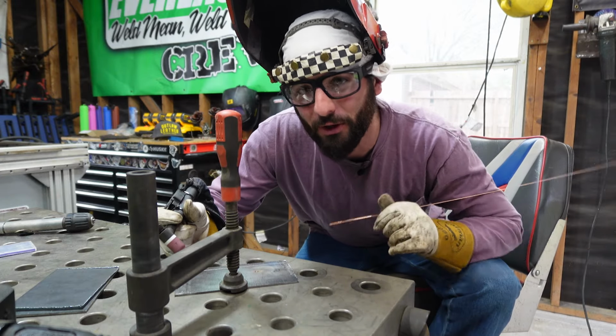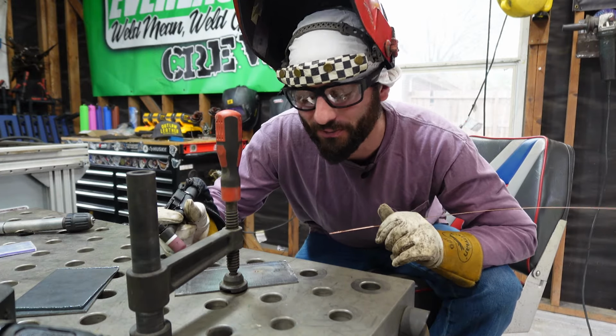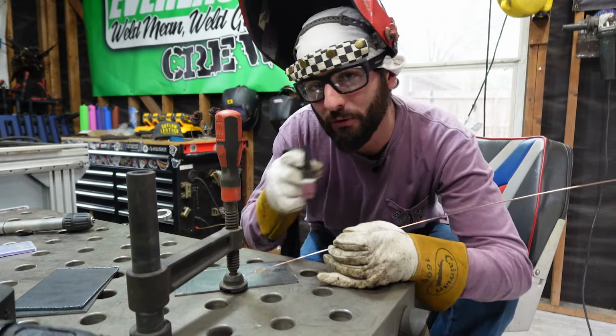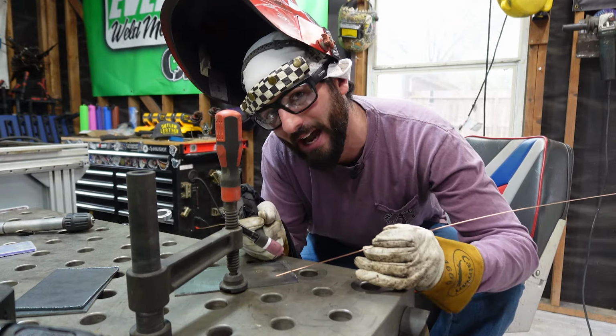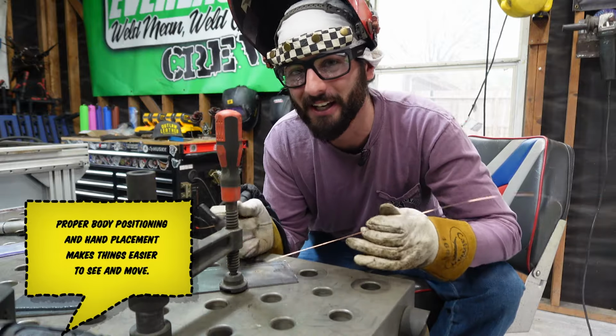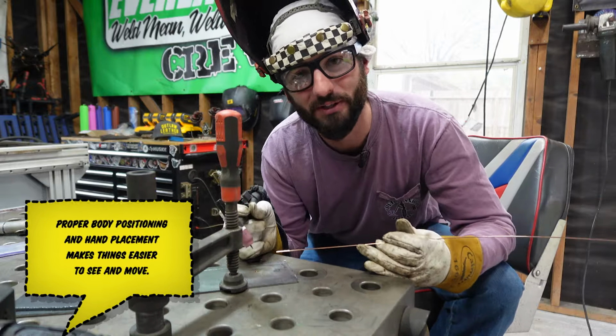That's how you know that your weld and yourselves are equals. It'll respect you for that. Once you're eye to eye with your weld, that won't force your torch angle to be so far back and that arc length burning your wire or balling it up, as I see in your pictures, just dropping some bombs.